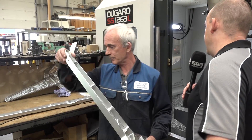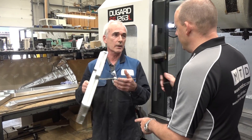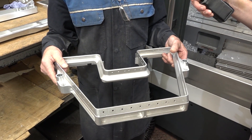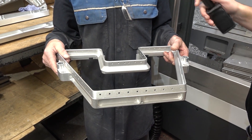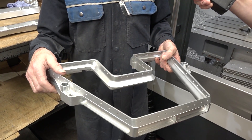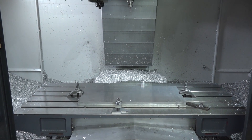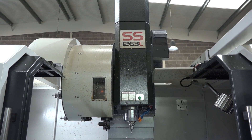There's one last part down here as well. Are you machining this out of a solid billet? Yeah. There's some material to come out of that — that's why we like that the machine is quite a powerful machine. For the first initial rough-out, it's half an hour to rough this out, and then of course if you're finishing up it'll take longer. So on a job like that it's about a three-hour cycle time, but that is split between a lot of operations still.